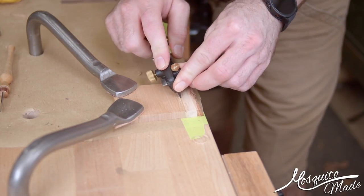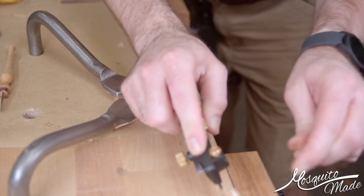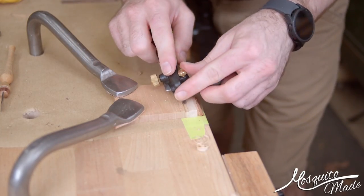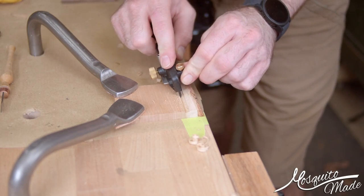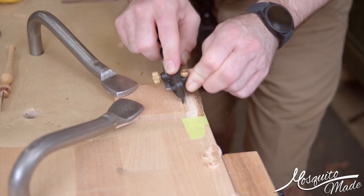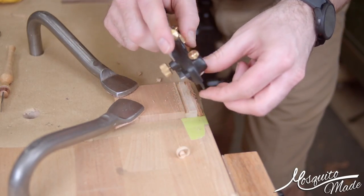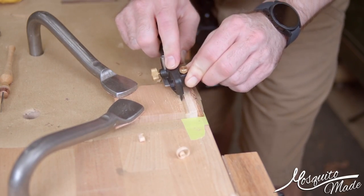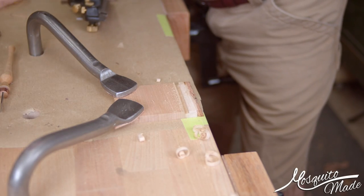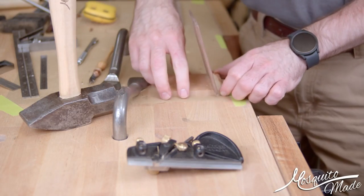This was sort of a last-minute thing that I tried out. I took a marking gauge — very much in the same fashion as doing a rabbit with a rabbit plane with no fence — and put a pretty heavy marking gauge line. Then I put the depth stop all the way up, removed the fence, and taking a pretty light cut so that the iron doesn't dig in too much versus the skate, I'm just leaning it over a little bit and following that knife line from the marking gauge, just kind of plowing a groove at an angle. I was kind of surprised that this actually worked, and the thing I was trying to put in it was actually held in it. Not really a normal use of the plane, but it worked.